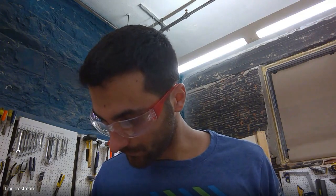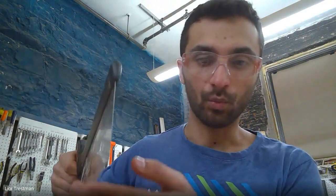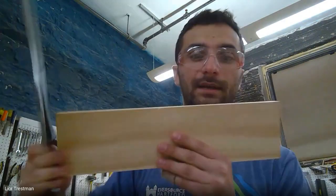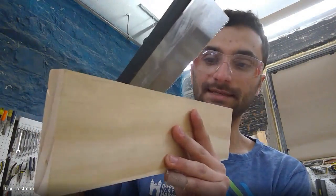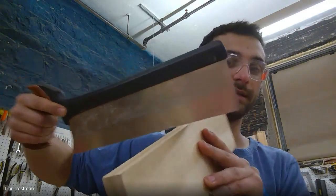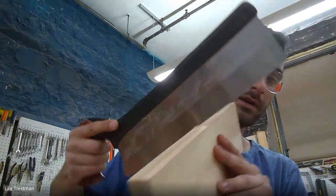If you might have a hand saw at home, grab some scrap wood or firewood and try cutting. It's definitely a skill to learn how to get the blade to bite without all those teeth engaging at once. In general, if this is a piece of wood you're trying to cut, you'd want to start by going at an angle and just get a little nick started, then get into it. If you try to start with full engagement across the surface, that's a lot of resistance. Break through those fibers in the corner first, then go through.